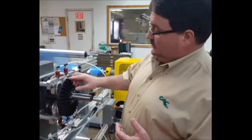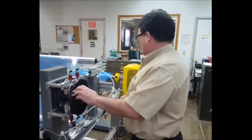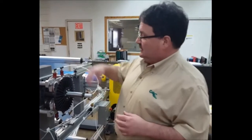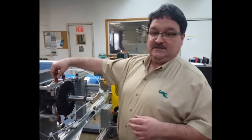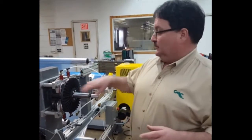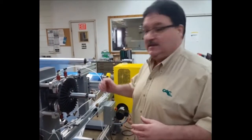So what I'm going to do is show you how this brake operates in a running condition. I'm going to engage one set of pads, and now that brake is locked — it's not completely locked up, but it will slip when I turn the rewind stand on. So now I'm going to start this equipment up.